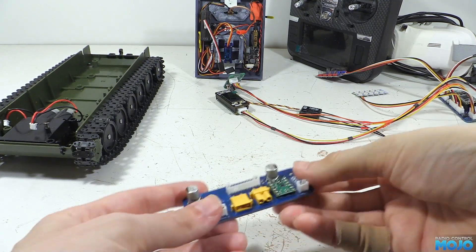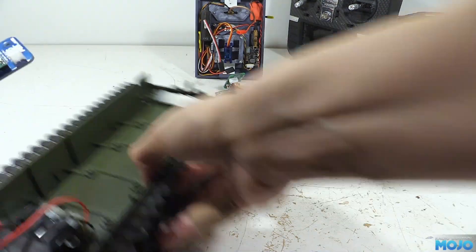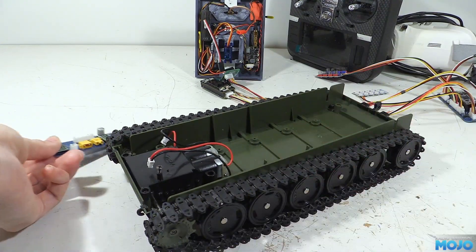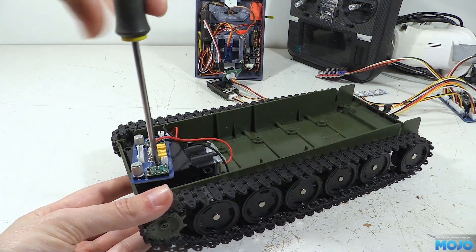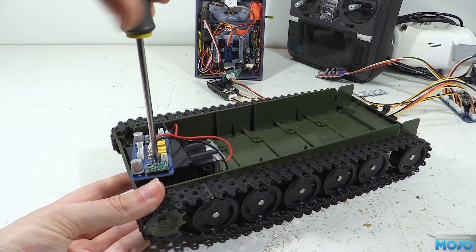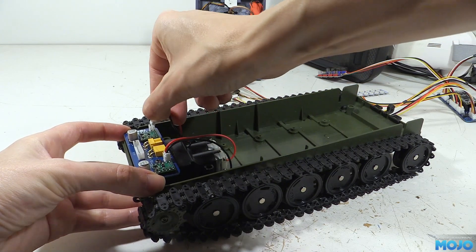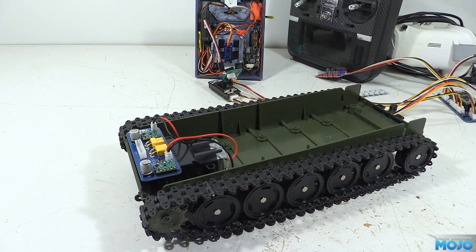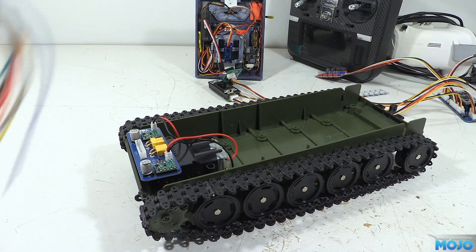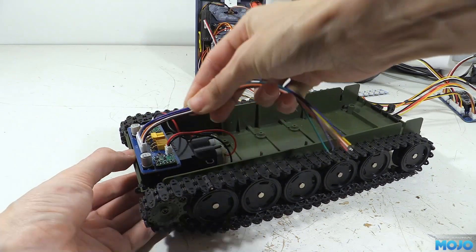This one is the last module, and a special one for the E1. It's a dual motor driver that fits up in the space where the stock controller lived. We just offer it up and fit the stock screw, and the motors then just plug in. There's a 10-pin connector that goes off to the logic board for control. The 10-pin is designed to be general purpose — so on a Tamiya lorry it might be used for a radio for a wireless trailer, or maybe if you only want a couple of LEDs it could be used instead of the NeoPixels or the 24 channel module. You just need to configure it.